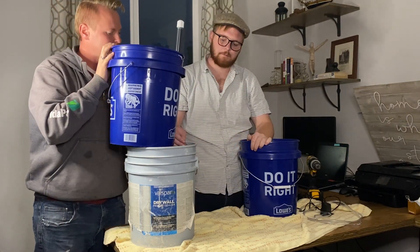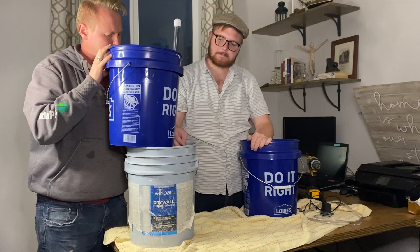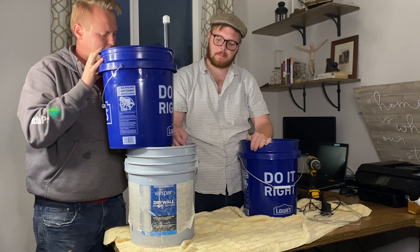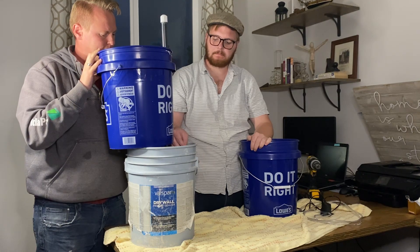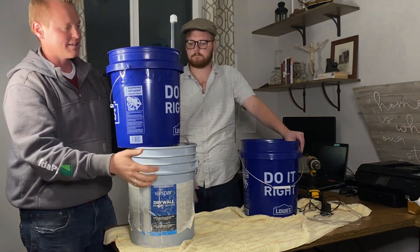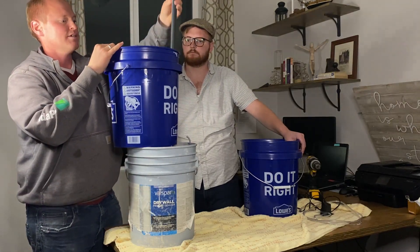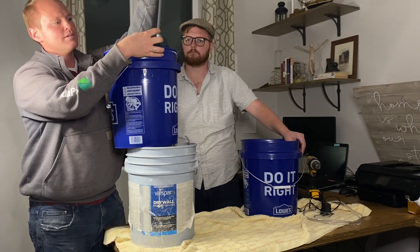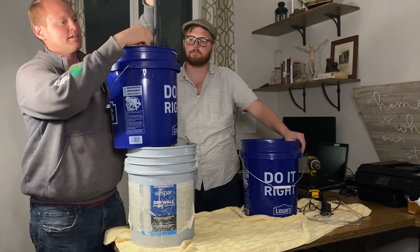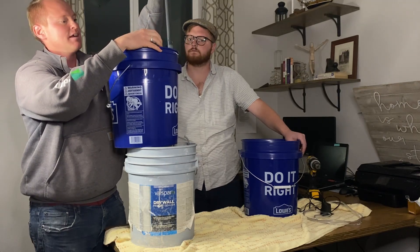We're right at the end. As you can see, we're barely getting any water out of this pipe. We tilt it just slightly to let air into the pipe — and there we go, that's it. The water drained down through the pipe into this bucket and stopped. We reached the bottom of the pipe where those holes are. The water continued down the clear pipe inside until the water level reached those holes, allowing air in and stopping the siphon.